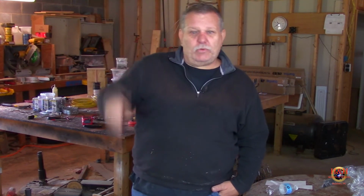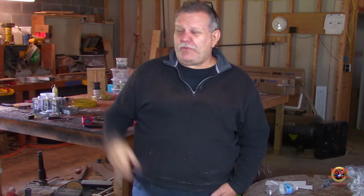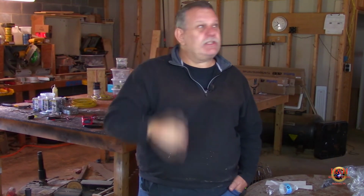So these are all spaced about 6 inches apart, with 2 little clips that hold them to the ceiling. The front of the shop had 1/4-inch OSB for the ceiling that was put up years ago, so it's kind of wavy. The back shop, me and my brother-in-law put up about 20 years ago. It's 7/16 OSB, back when you could get it fairly inexpensive. I put the lights 3 foot on center, just like the front of the shop, except that it spaced out to 6 inches, and I went pretty much to the end of the wall.